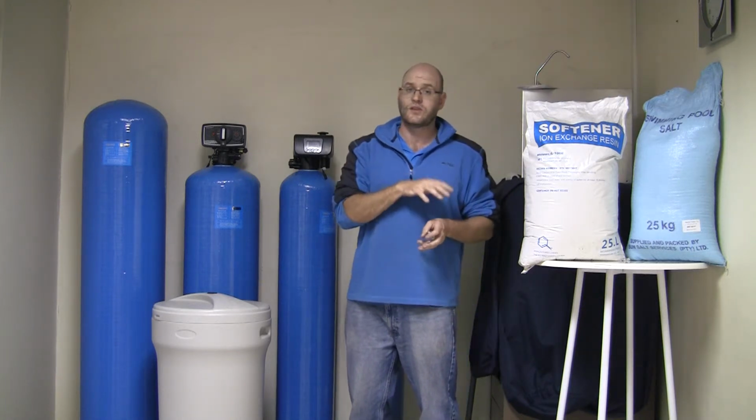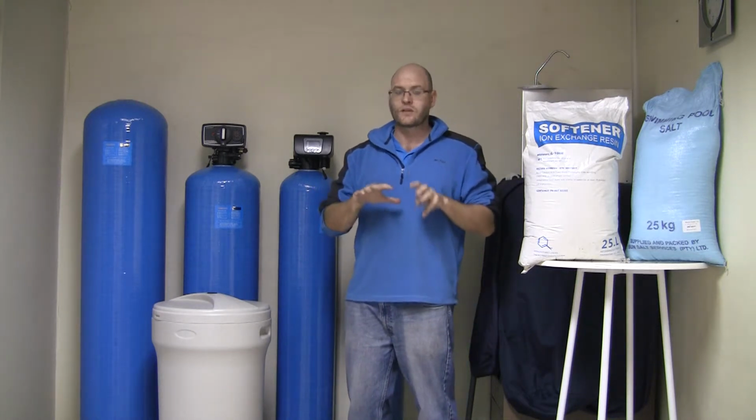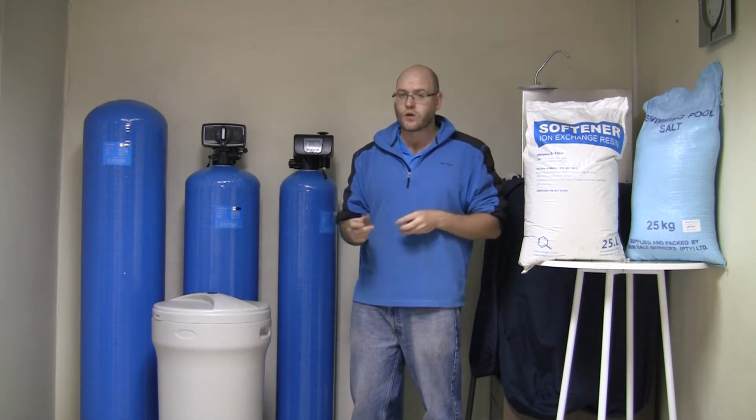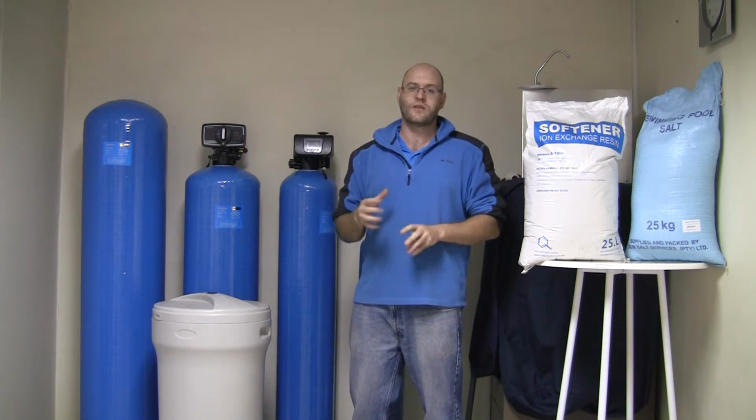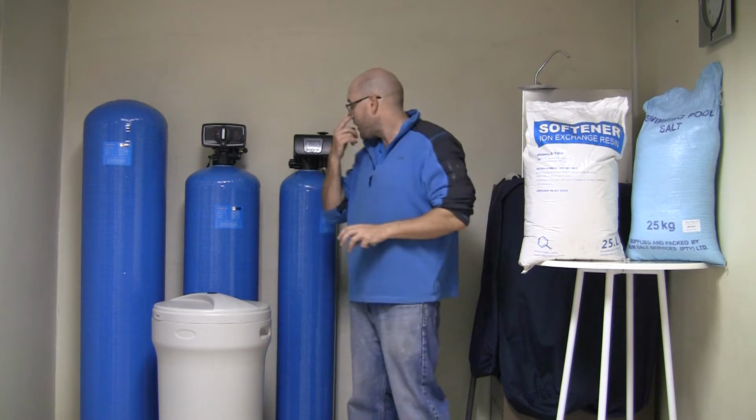If your water didn't have a salty taste, you put a softener in place and it does suddenly have a salty taste, something's not running correctly on the softener. Either a setting's wrong or one of the piping isn't correct. And if you are having that issue, you can always contact us and we'll take you through that.